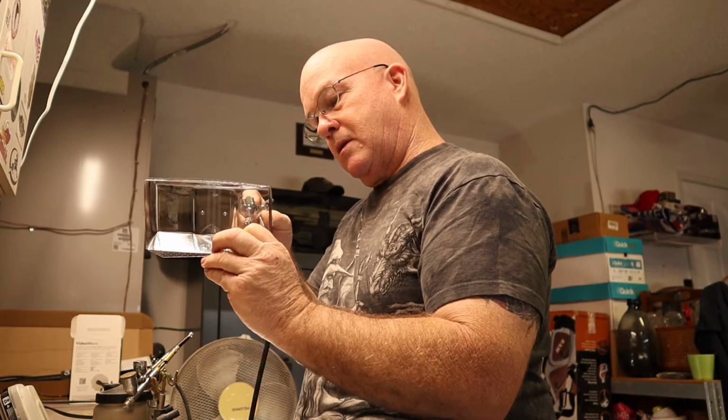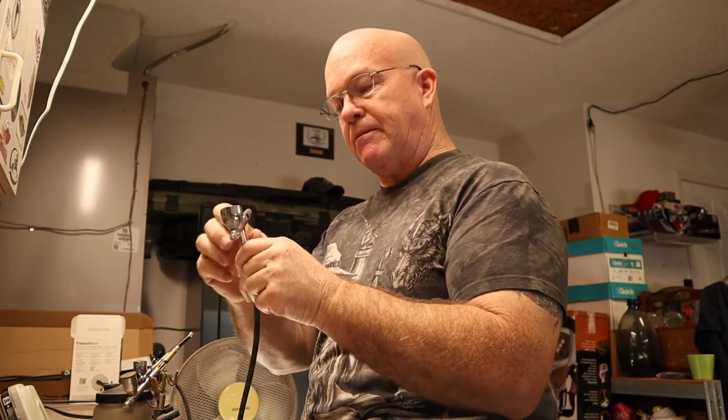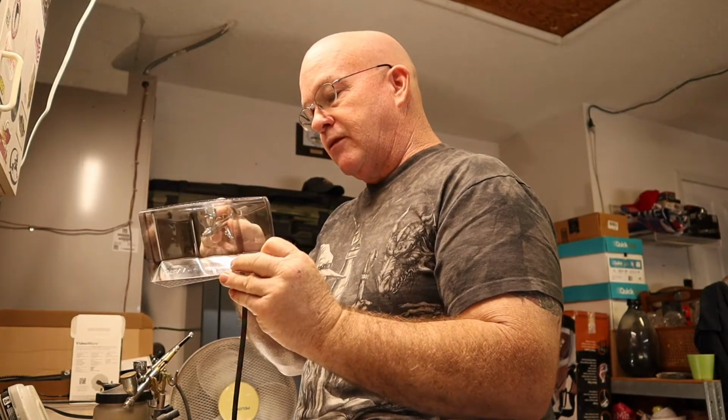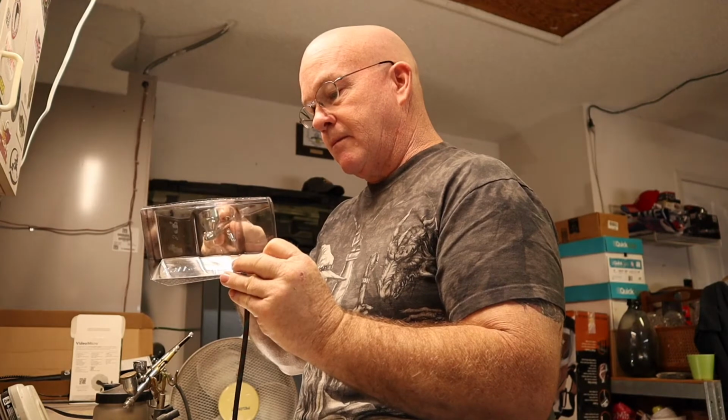One of the mistakes a lot of painters do is, the airbrush can let out air and material. So when you're done spraying your material, you always want to stop the material and keep the air going before you let off the air. A lot of inexperienced painters will be spraying paint and they'll just let up, and that's when it'll splatter on the surface. So that's what you want to avoid, by stopping the material flow while you're keeping air pressure flowing.